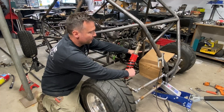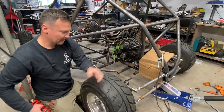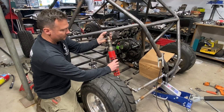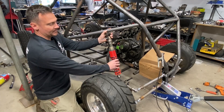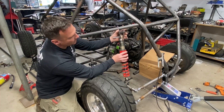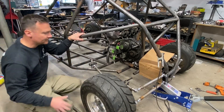Redoing the rear verticals for the motor mount uprights changed our shock location, so we've got to cut these tabs off and realign our rear suspension. I thought — and it's still not too late — to do it as an official trailing arm setup, have the springs facing backwards. That way I can run stiffer springs and get more travel. That would look cool. But we'll see how this works for now. If it's too soft, we'll fix it. Let's do it.